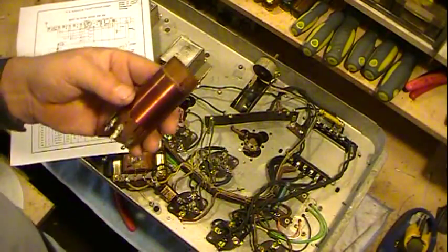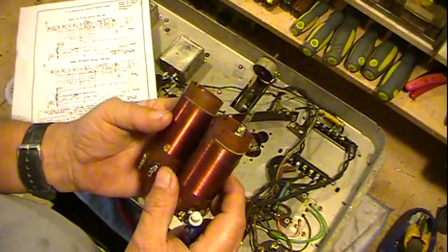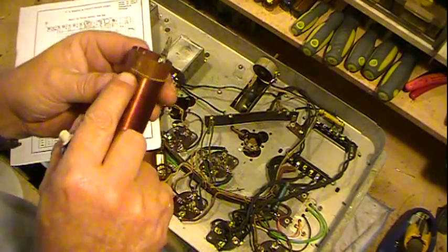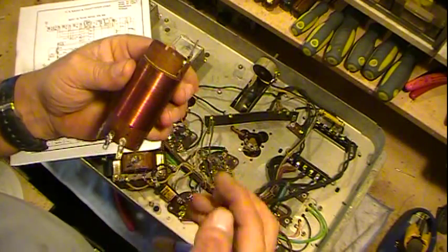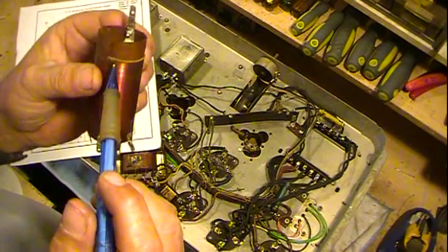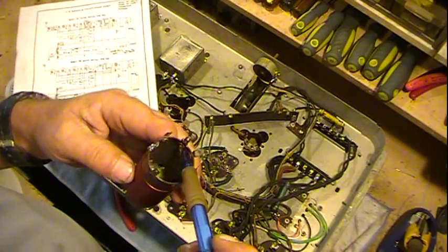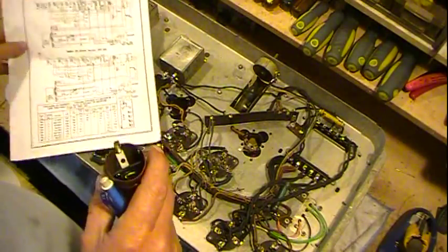If you take a look at the coil, it's here on all of them. Here's the other one. But the capacitor's there. And it's not hid down inside. It's actually right here. That's it. That's the capacitor. This lead, this wire, stops right here. It's just tied off right in there. Comes around and goes down and comes down inside here and comes up and hooks here, and that's hooking to that primary side of the coil, the primary right here.